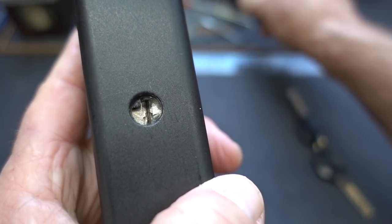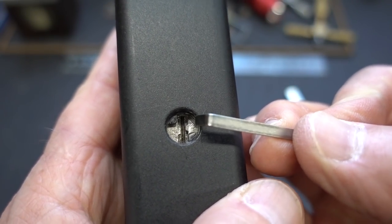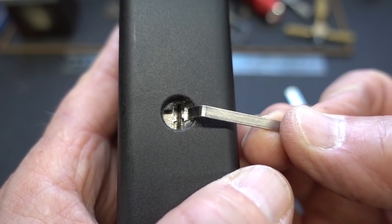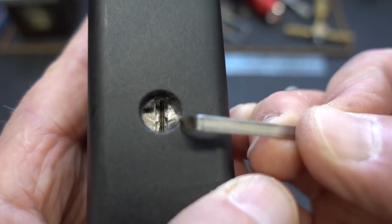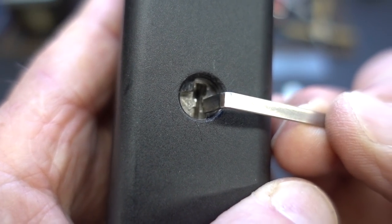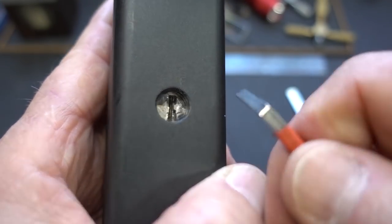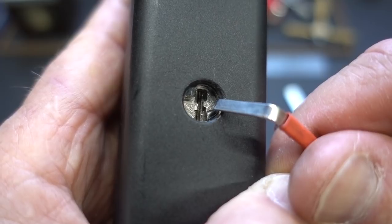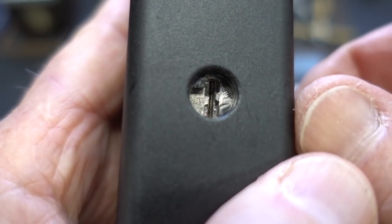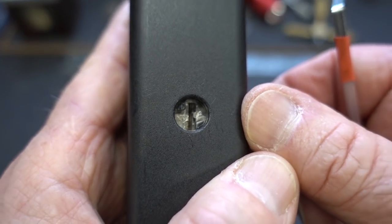Before we do that, let me grab a tensioner. You notice on this tensioner we have a couple of things. The outer plate is new — we haven't seen that before. That's a restrictor plate. On that restrictor plate it looks like a figure eight with a real tight waist right in the middle. So the attack where we put the pick in and kind of roll everything in place — that restrictor is going to prevent that, going to prevent us from sliding everything over. Also behind that restrictor plate, we have a shutter to keep all the debris and everything out.